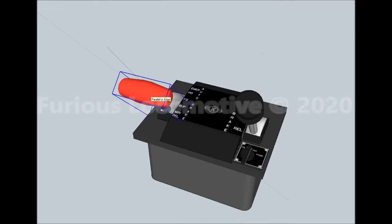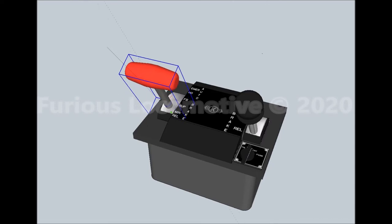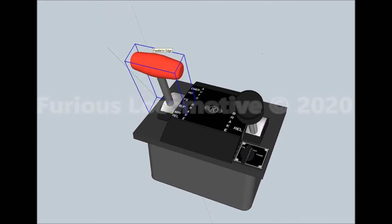Release position is selected when charging a train or releasing automatic air brake applications. The handle position release is the closest position to the engineer. The minimum reduction position provides 5 to 7 psi reduction of air brake pipe pressure. Moving the automatic brake handle away from the engineer into the service zone increases the reduction.